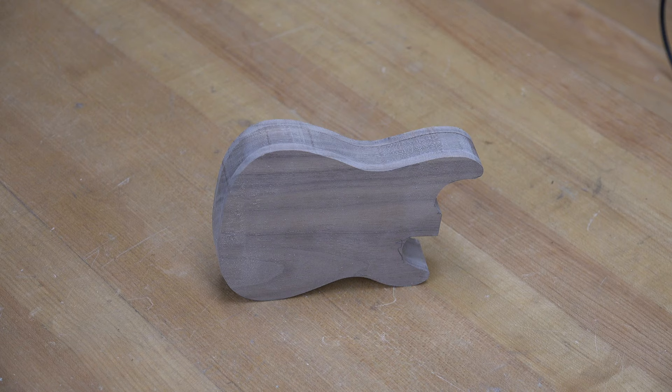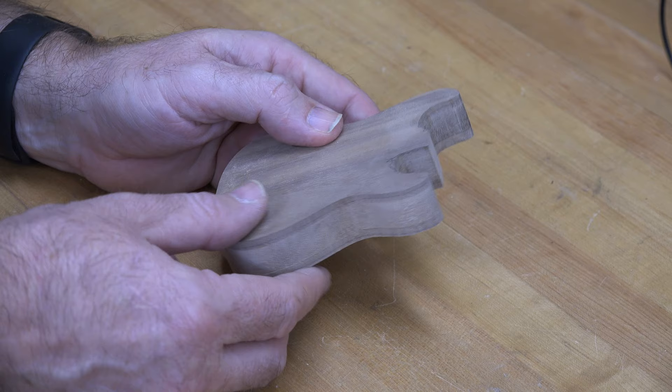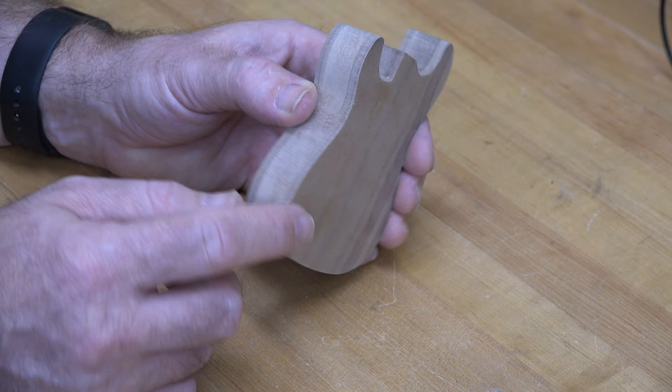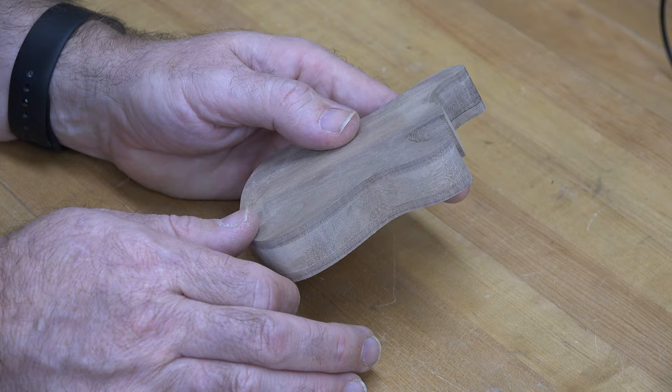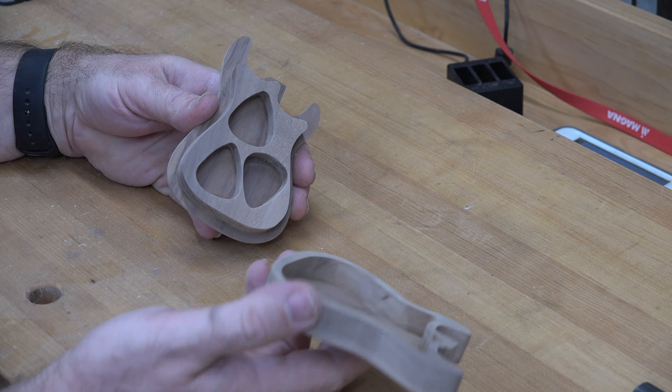With the main body shape cut, take the opportunity to give the whole thing a good sanding all around, taking off any sharp corners on the outside edges. Keep the pieces together while sanding — if you round the bottom edges of the lid or the top edges of the base, you'll end up with gaps and it'll look strange. Once sanding is done, you have an awesome little box to store your guitar picks.